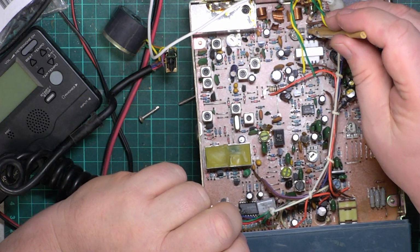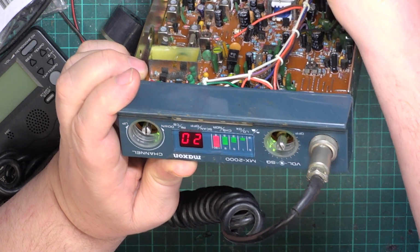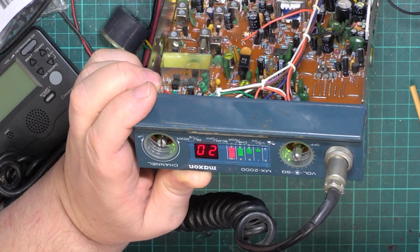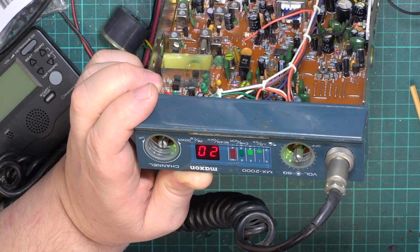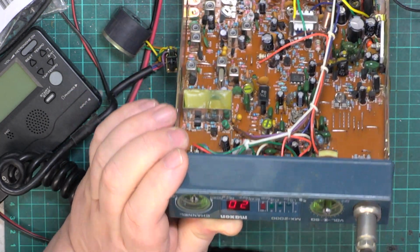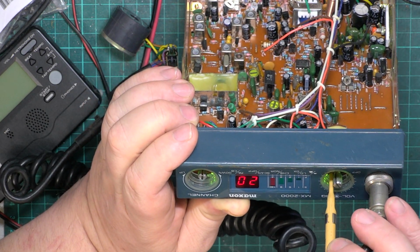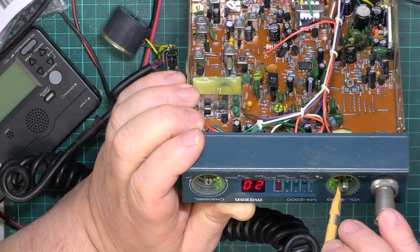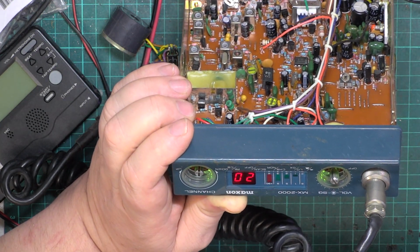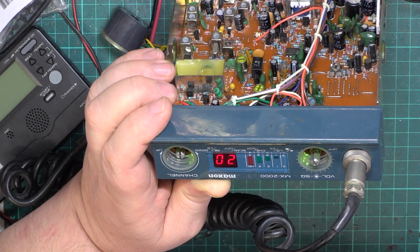I'll tell you what, it's difficult to get the plus 31 to light. And actually, in fact, that's where we want it. So I've been able to set it up. I'm glad I was right. Let's see whether we can work out the squelch sensitivity with making the squelch go to threshold position. So that's threshold. Carefully get it to there. Switch the signal generator on, which is parked at 0.3 of a microvolt. That's 3.